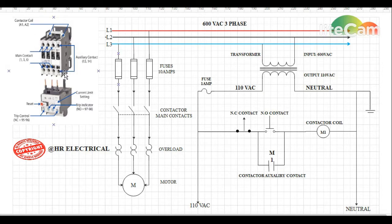I will briefly describe the main components of it. The contactor coil is the most important part of the contactor, where you supply the control voltage. The control voltage could be 110 volt or 24 volt — it all depends on the circuit requirement. When the control voltage is supplied to the contactor coil, the magnet inside the contactor will pull the main contacts in, which will allow power to transfer from the main terminals onto the overload.